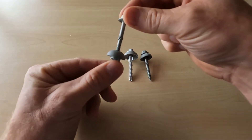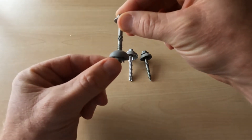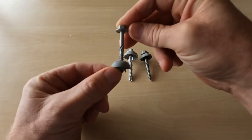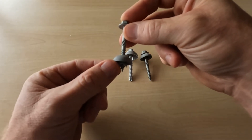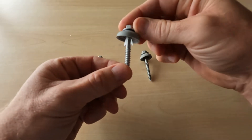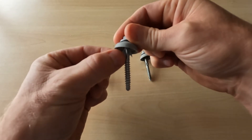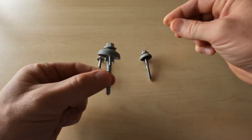This is the one-shot fastener that we sell — it's actually got a hole cutter underneath the washer and that cuts the expansion hole at the same time when you screw it down into the sheet. This multi-purpose fastener also has a hole cutter under the washer and it won't cut the hole until the very end once it's fastened down.